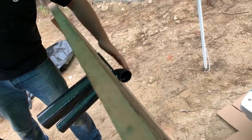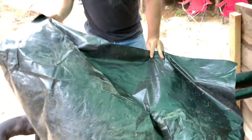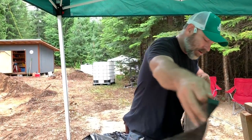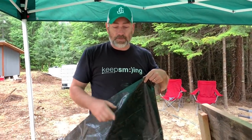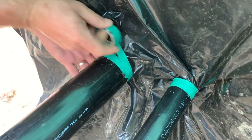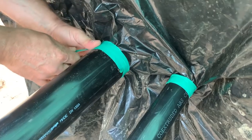All right, so we got the pipe in here. Check it out - this side - it's gonna fit in there. And then we're gonna use this plastic to actually cover the hole so that all the smells don't come out. We need to measure it around these pipes and then cut the hole for the pipe and tape it around the pipe so it'll seal it. So we got the holes cut for the plastic - we're just gonna tape them on here so they don't come off and we can seal it up so that none of the sewer gases come up and make our bathroom stink.